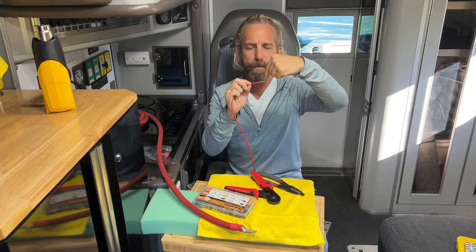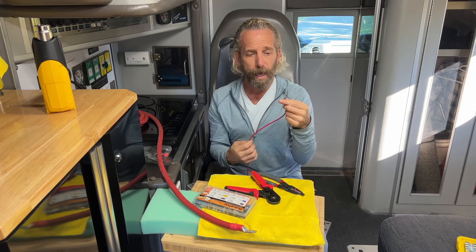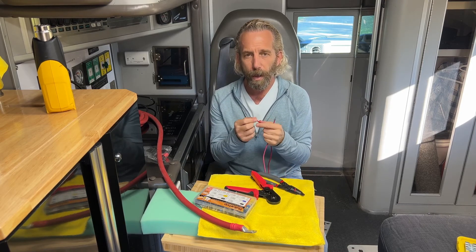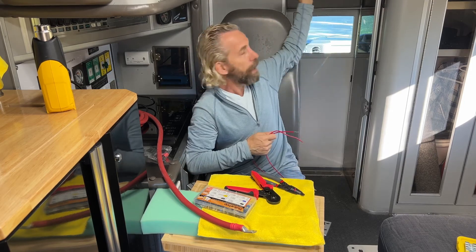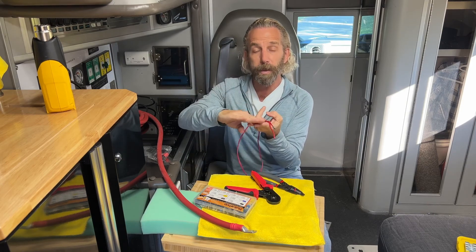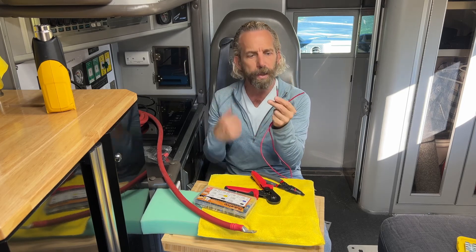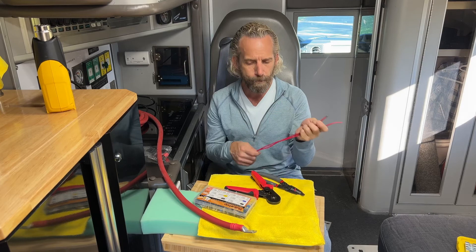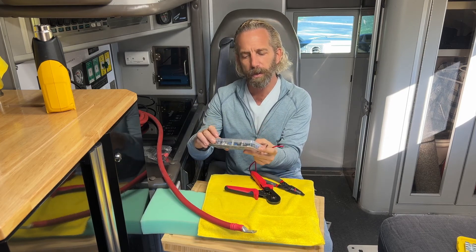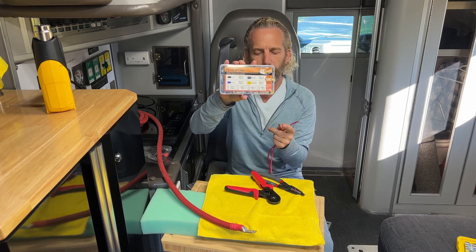Done. Now you have a square terminal — it's hard to see, but we have a square all the way around, and that's really what you want. When you're tightening down the screw on a terminal — whether it's a circuit breaker or any other terminal — you want that screw to have the highest surface area so the electrons can flow. That's especially important for DC. When you strip the wire you see many strands; when you put that under a terminal those strands can come apart, which is why terminals often use a fork or a plate. This ferrule prevents that.